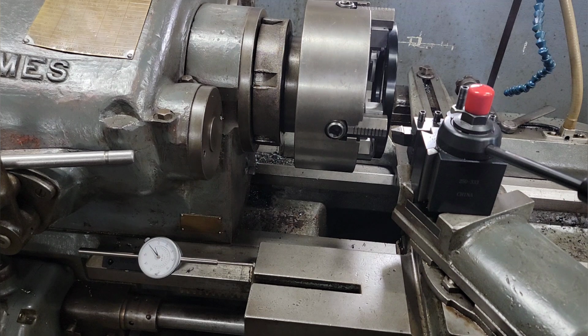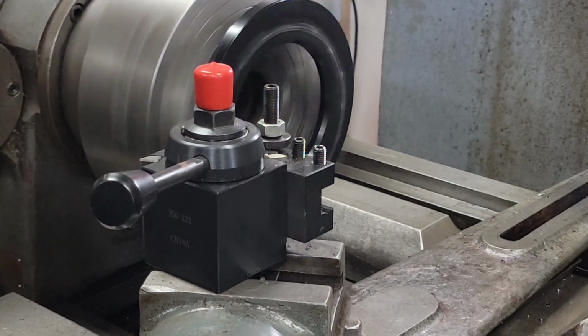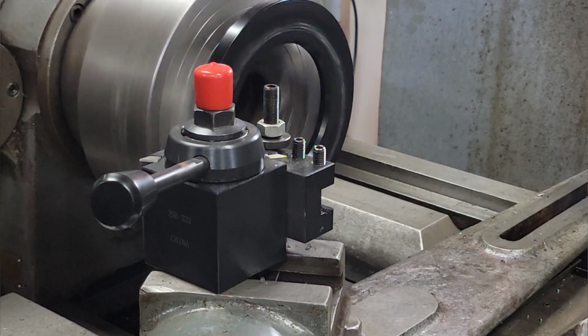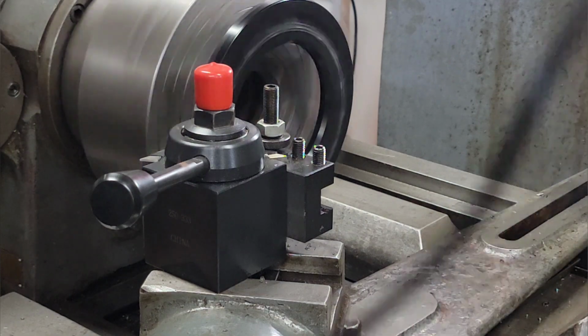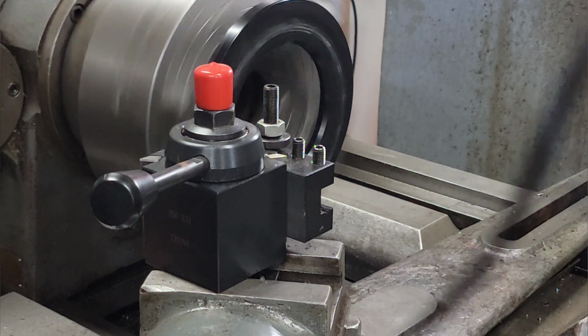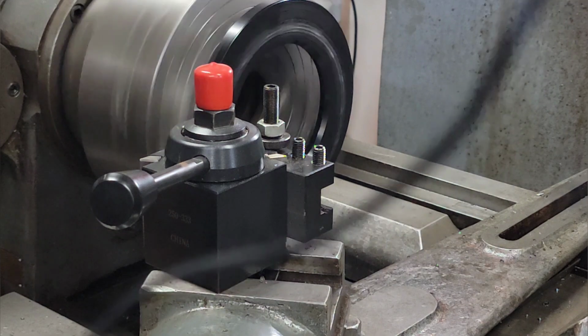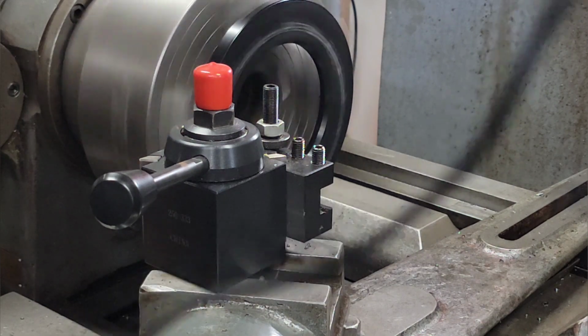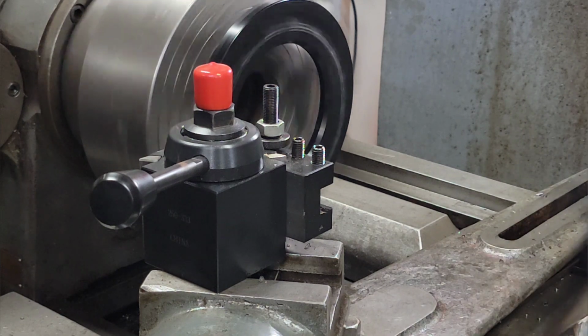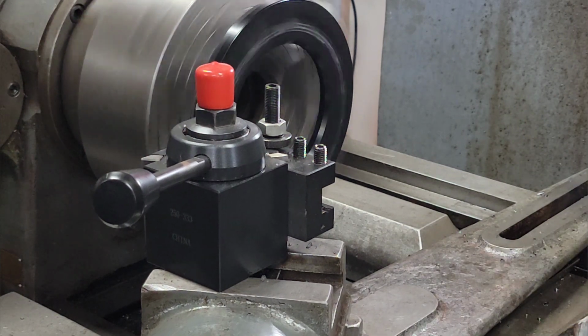All right, hang tight. I'm going to move you. I'm going to get you fired up, get you a good seat for watching the machining process. All right, we're sitting at 480 RPM, 11 thousandths per rev feed. And we're going to try taking probably 20 thou off to see what that does. Let's start just a little on the slow side. Run that, see how that does.